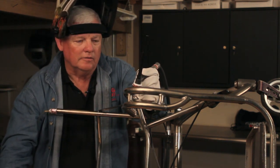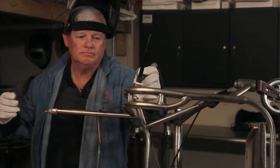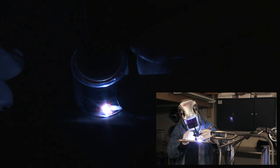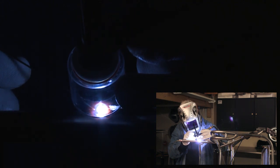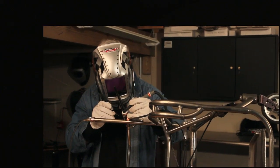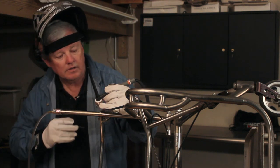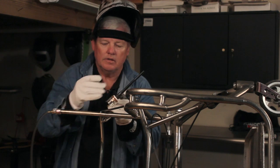I think the crack started from one edge here, so I just want to put a little extra reinforcement. This is the last weld on the bracket. We can see where it was cracked before — we're consuming that portion and doing a little deeper penetration on this one. I'm out of position right now, so I'm stopping and letting the argon cool. That looks good — now I'm going to go to the other side.